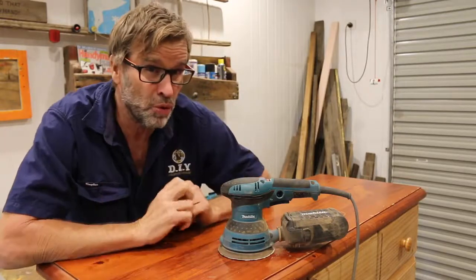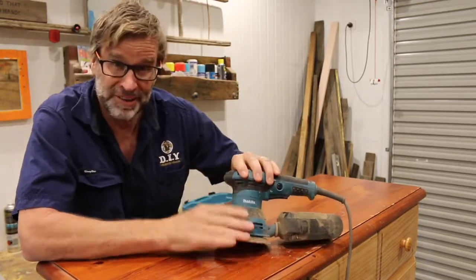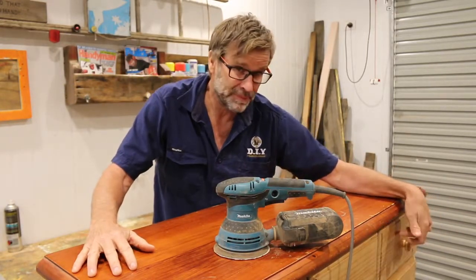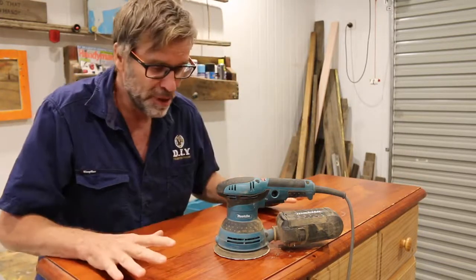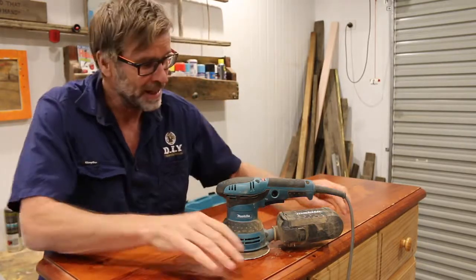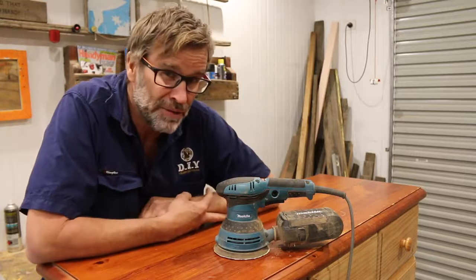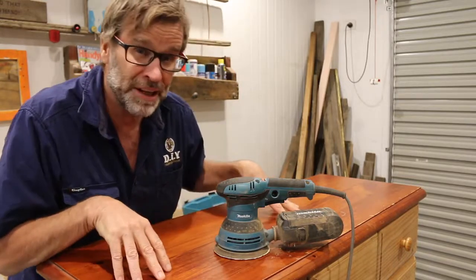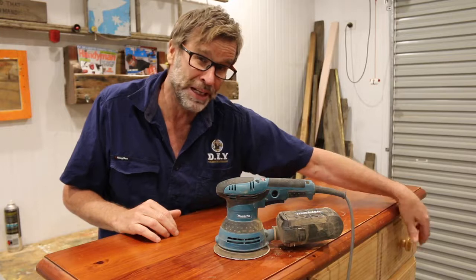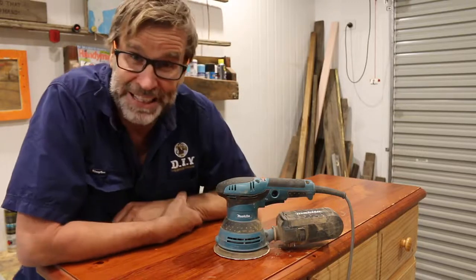So how do you go about obtaining that beautiful whitewashed effect? Well, it's really simple. What I'm going to be doing is with my orbital sander, I'll be sanding all this stain off and going back to the raw pine finish. Some people, when they're whitewashing and the piece is already stained or painted, will just give it a light sand and then apply the whitewash, and then sand a few little bits off here and there, which will bring the underneath colour up and through, giving off that aged appearance. For this project, we're after the Scandi feel, which means going back to the raw pine, and when the whitewashing paint has been applied and dried, the grain from the pine will come through, giving off that beautiful Scandinavian appearance.